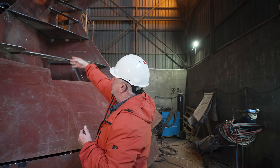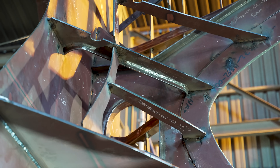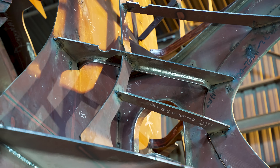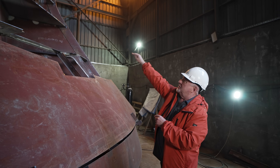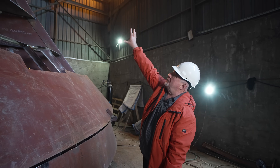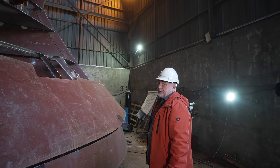This is a collision bulkhead — you can see it's a collision bulkhead. We don't have any hatches, any penetrations except for pipe penetrations for hydraulics, windlasses, and such. Above this deck plate — below in this case — is all chain locker. This collision bulkhead is not serviceable, it's kind of locked out, and we have a bilge pump there.